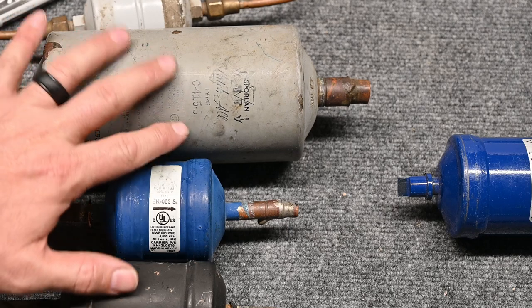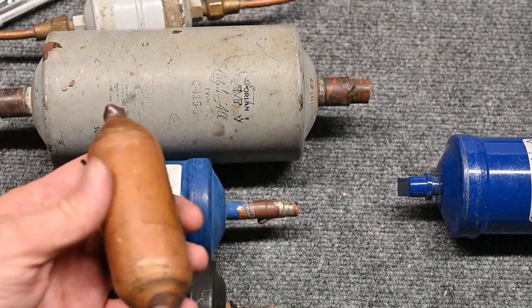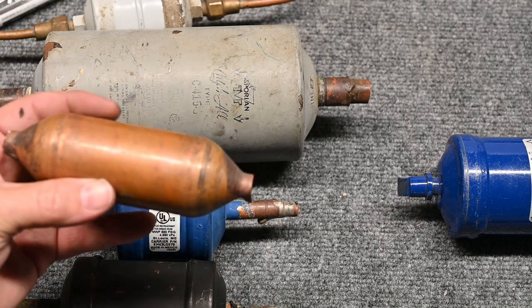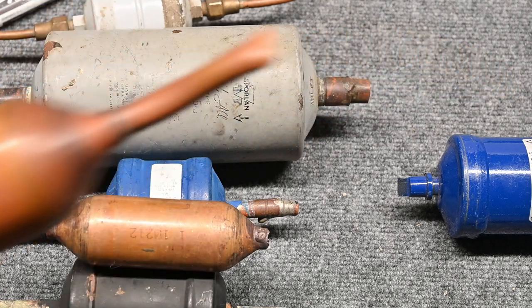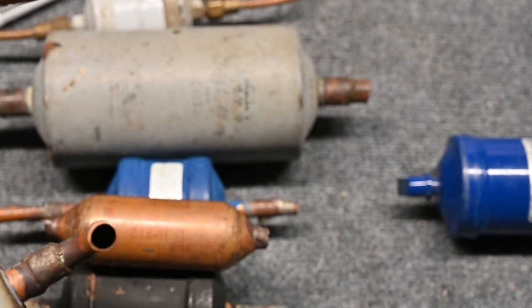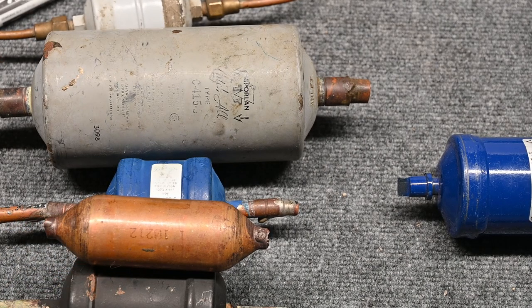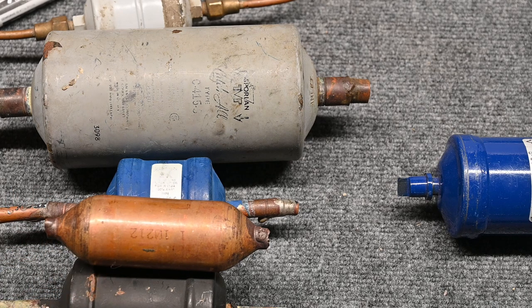Not all filter dryers are going to have this metal painted end. Some of the manufacturers — the factory ones — use filter dryers like this, and inside is your desiccant material. It looks a little bit different, but it's still a filter dryer. However, there's a little bit of a catch: sometimes you end up working with mufflers, and a muffler may look the same as this liquid line filter dryer. This is an example of a muffler — another example of a muffler. Both of these are mufflers — they're hollow inside. But a muffler is going to be on the discharge line, and a filter dryer should be on the liquid line.